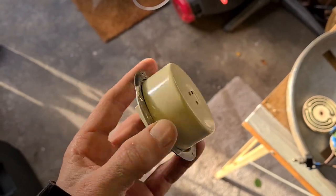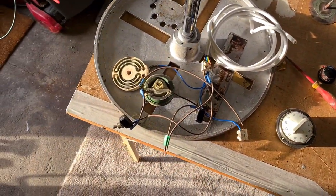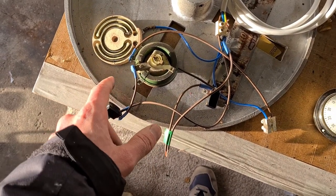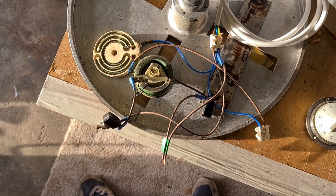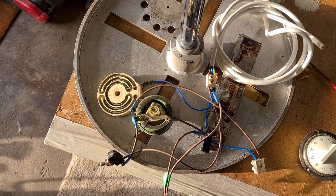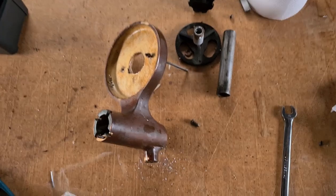I've done quite a decent amount of work today. The rewiring's all done. I've actually rewired it and put a little bit of heat shrink around some of the connectors because they are a little bit exposed, and with everything being varying types of metal, I don't particularly want the whole thing to become live while I'm using it.